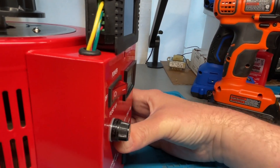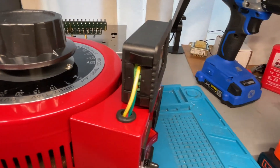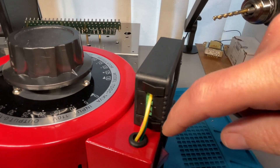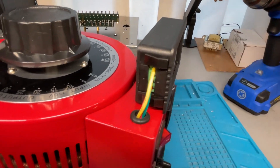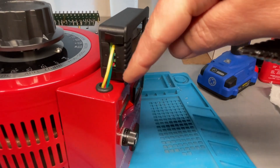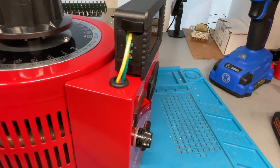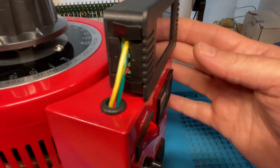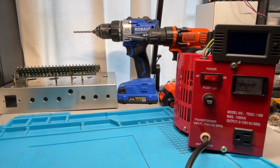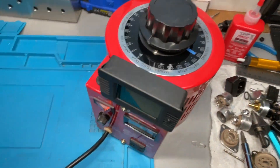Another thing to keep in mind: I used a drill to make a pilot hole, then used a stepper bit to widen the hole and put in a rubber grommet to keep the wires together. Then I hot-glued the meter to the actual unit before closing everything up. There's a little space inside where I can tuck the clamp unit, and then I screw the front panel back on.